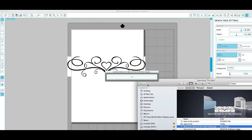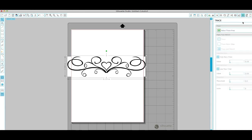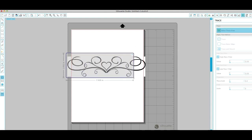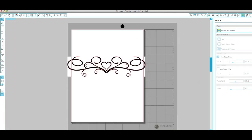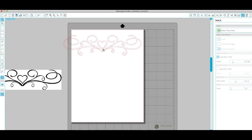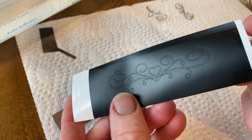I'm going to run you through basically the whole etching process. I know I've done quite a few etching videos — this is just another one for the collection. The scroll I actually drew in a graphic art program called CorelDRAW and imported it into Silhouette Cameo's software. The Silhouette Cameo is a vinyl cutting machine. It traces any solid black silhouette, and the red lines you're seeing are the cut lines — the lines the machine will actually cut out. I sized that scroll to where I wanted it and the Cameo machine cut it out on self-adhesive vinyl.